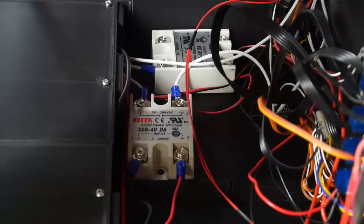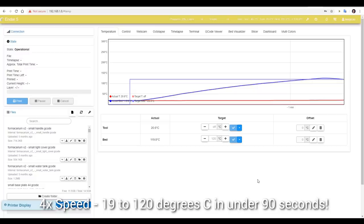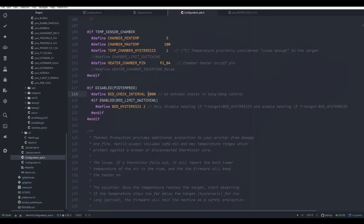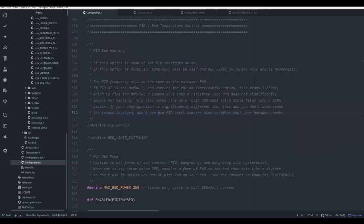Since heated bed performance is normally quite slow, with this new power comes new responsibility — we should tweak our thermal runaway settings in configuration_adv.h. I recommend reducing the seconds for THERMAL_PROTECTION_BED_PERIOD and BED_TEMP_PERIOD as low as you can without false positives. After we upload the new firmware and ask the heated bed to do its thing, a light will come on on the SSR to indicate current is flowing. Repeating our test from around 19 degrees, it now reaches the target temperature in under 90 seconds. However, it starts to fluctuate up and down because for this version of the firmware the bed is using bang-bang control — simple switching on and off of the heater — producing oscillations in bed temperature which we definitely don't want. I fiddled with the bed limit switching parameters but didn't really have much luck; the magnitude of the swings decreased but they were definitely still there.